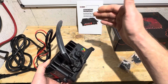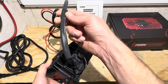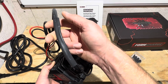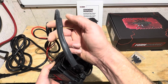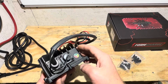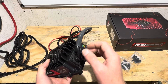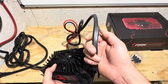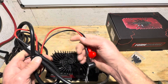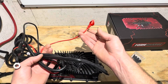I'm assuming their microprocessor will cut power on the DC side if it sees an over-temperature condition, or they may be using it as a 32-degree F cold protection feature. I will find out more about that — per the literature, that sensor is a high-temp protection sensor. We also have a state-of-charge indicator light. So all kinds of safeguards built into this unit.